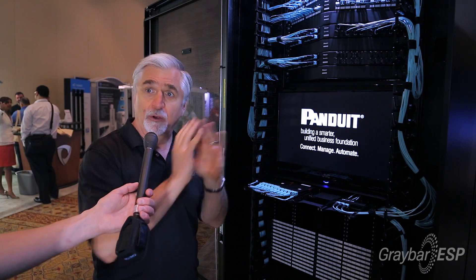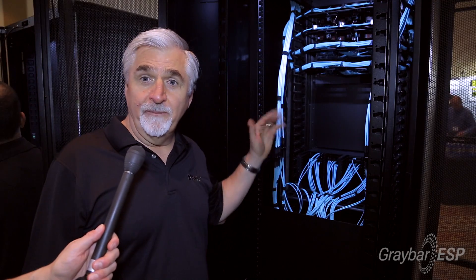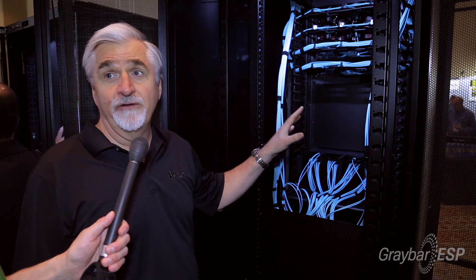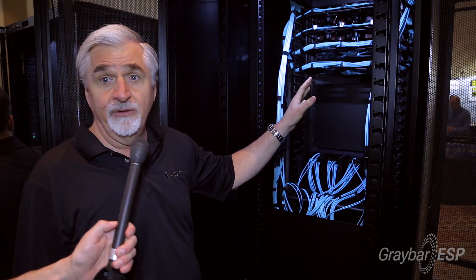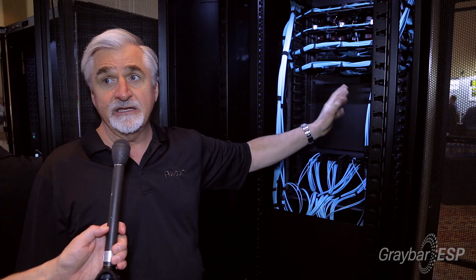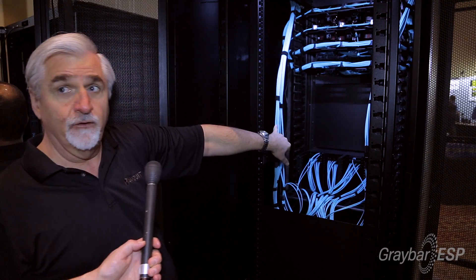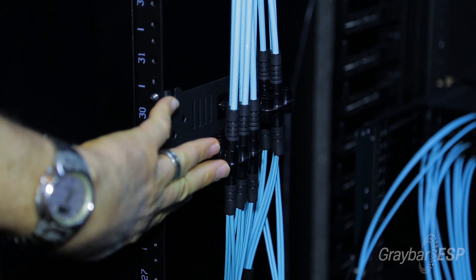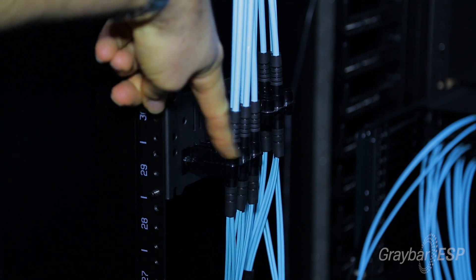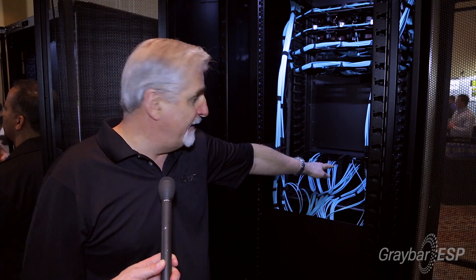So designed for now, but we're looking also ahead for the future when you need to upgrade. We're now at the back of the cabinet, and we haven't forgotten what needs to be done there either. A lot of folks just let the cabling hang and not manage it really well. So what we've done is we're using our small diameter trunk cables — this is a 24-fibre trunk which has 12-fibre breakouts. At the breakout we've got a nice little feature that allows us to manage the cable really well before it goes into the cassettes at the back.